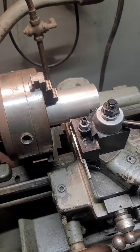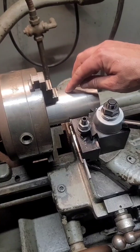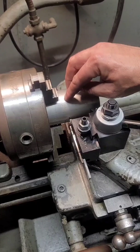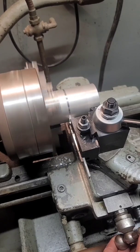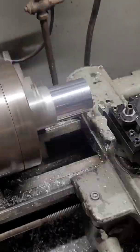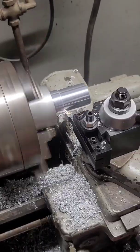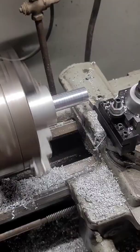I've got the metal set up in the chuck and I've got my parting tool here. I'm going to make a mark where I'll be stopping — this area will turn down to about three-quarters of an inch. I'll put a mark in here so we'll know where to stop on our travel.